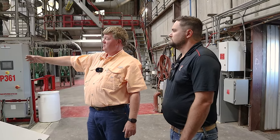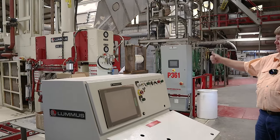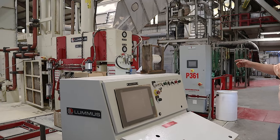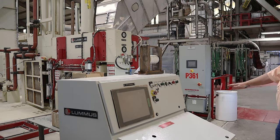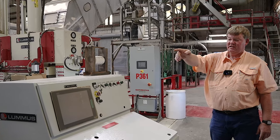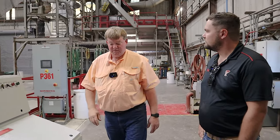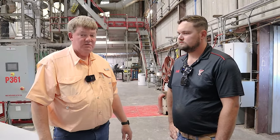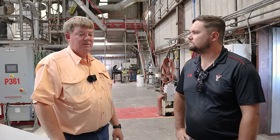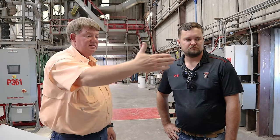Once that tramper hits its spot, it tells the press to turn. It turns, it locks, starts the tramper again, starts the bottom ram up, gets to where it goes. Everything ties, straps, done. That lets go. Bottom ram goes down, bale falls out, goes over here, gets pushed through the bag, gets sampled and all that good stuff, and gets over here, and then it stops. That's the first time that you have to have some human touch, because there's a button right there. Whenever the person closing the top and getting the tags on is finished, they'll hit that button, the bale turns back a quarter turn and heads out the door.